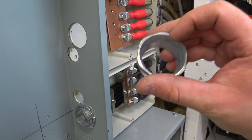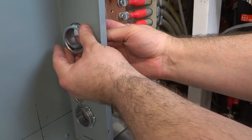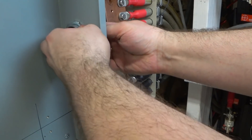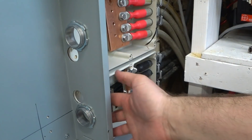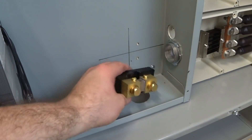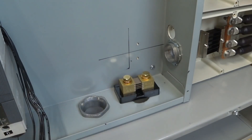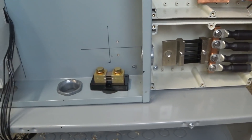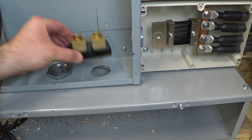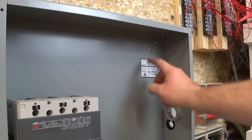Here's a 1¼-inch chase nipple — smooth on one side. We'll throw that into the opening and then there's a lock ring to tighten these two up. I have a shunt here that I marked out and pre-drilled for — that's going to go right here. So there are actually two shunts on this assembly: this one is for the Chargery BMS and this one I had to buy for the inverters. Up in this corner is a dimple where the grounding screw goes.